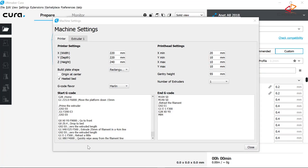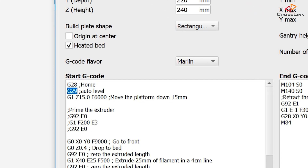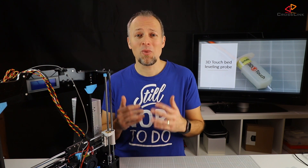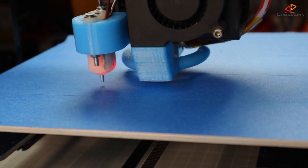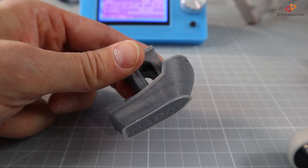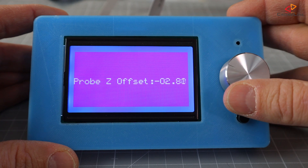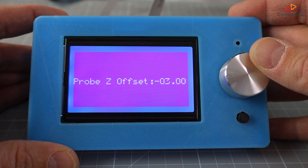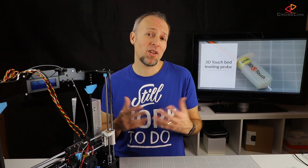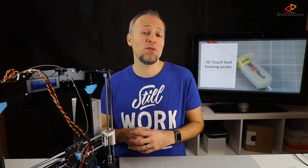As a last step, you just need to insert one line of G-code to your slicer's preprint script with the G29 command. This command will trigger the bed leveling every time you start a new print. Don't forget that if you are printing old files that you already sliced, this command will be missing in those files. Now we are ready to do our first test print and see if our settings match what we need for best first layer adhesion. I actually found that I want to lower the Z offset even around 0.2 mm further to increase the pressure to the heat bed a bit more. This gave me the best results for adhesion on blue painter's tape. For another print surface this might not be needed, and on glass this might be even a bit dangerous. So be careful and find your own sweet spot.